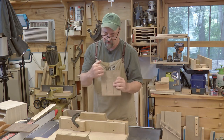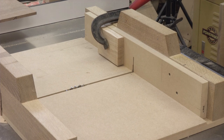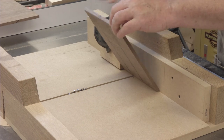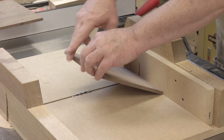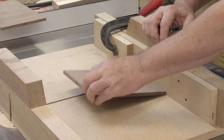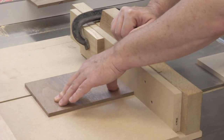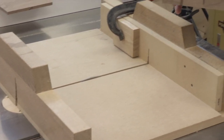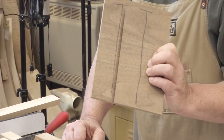The sled is not moving back. I'm just going to drop it down to start this cut and push the thing all the way through. The piece is flush against the fence and flush against the stop. As I'm dropping it, I'm making sure my fingers are not in line with the blade. And there it is — we stopped right to our line, through on the back. Pretty simple stuff.